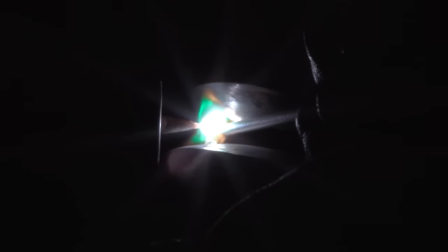With this, you don't want to make too large of movements — real small movements with your tungsten. Just make sure you get the puddle to break down your bevel edges.